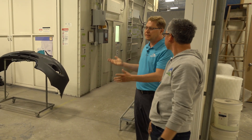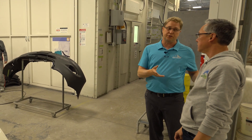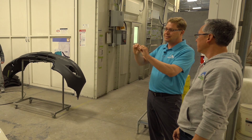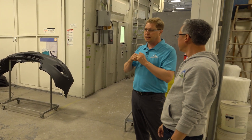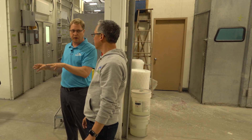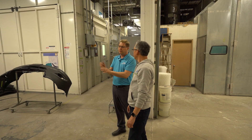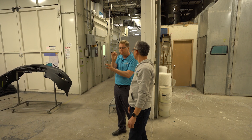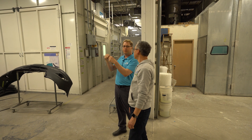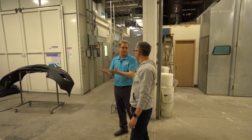There are quicker and easier ways of doing it. You could just tape off a van and spray the moldings right on and live with it. But that's not the way that we want to do it. We want to make sure when that part gets reestablished onto the side, it's painted all the way around. If you mask it and tape it off, you're going to see black underlying from that part. And that's where moisture can get in and start flaking off that paint.